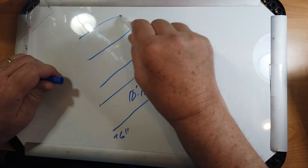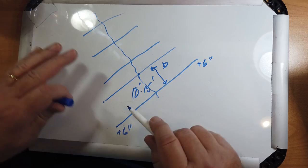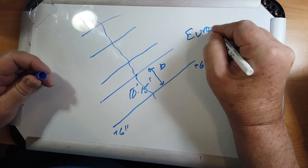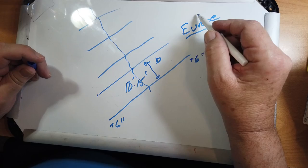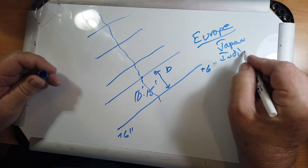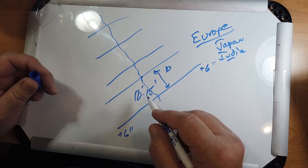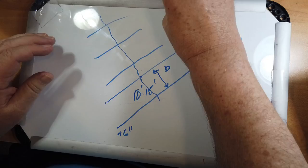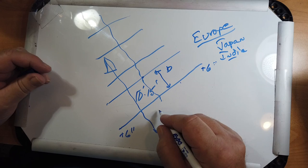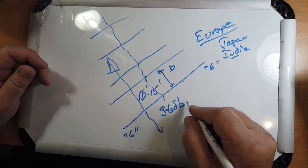If you want, you can put up directors out here as well — look at the programs for designing this. If you hang this and make it out of wire, you can point it in one direction. Like you're in South Africa, Europe might be a good idea. But also don't forget North America, don't forget Japan and places like that, where there are lots of hams. There are also lots of hams in India, that for us Americans are really hard to work, but might be easier for you to do. You will definitely find a strong directional characteristic this way. You'll still get some signal the other way, but they'll be three to six dB down from the stations that you get in the main direction.